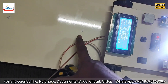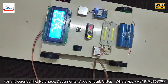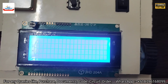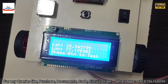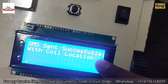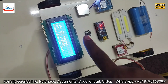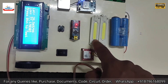Now let's move the car to spot three. The car is now just above spot three. We will check whether the coil is working or not. After pressing the test button, you can see 'Coil Voltage Faulty' — that's why it is showing 'SMS sent to the respective device'. Let's press the button again to confirm — coil quality is faulty and SMS has been sent with the location of the faulty coil. This means coil number three is faulty because we intentionally left it off for testing purposes, and the LED is also not glowing.